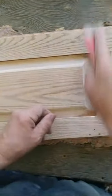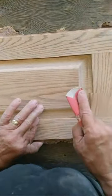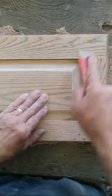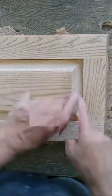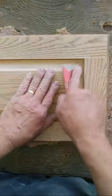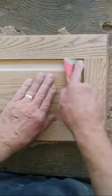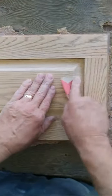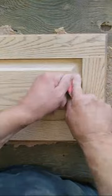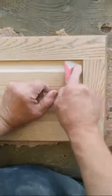And I'm not going cross grain, you notice. I'm sliding down at an angle like this, or else I'll leave scratches if I cross the grain. You have to work to take the cuts out of the grain if you cross sand, and that's a lot more work.